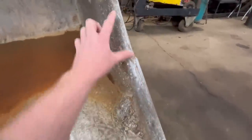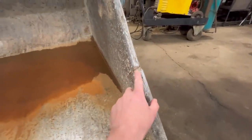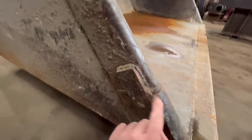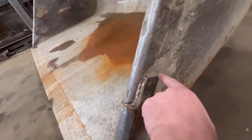Like this one's done. I think because of that bit's welded onto there, that weld always causes a weak spot. So it's cracked there. It's cracked at this side. You can see it's had a farmer repair, someone's welded a plate on there, but it's cracked again across where that is. So this side has also had that plate welded on and that's started to crack across there again. And then underneath where they have the wear pads worn in the corner, you can see that's cracked all the way around as well, so that's all to repair.